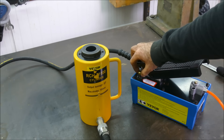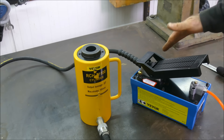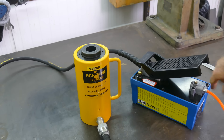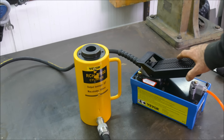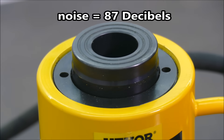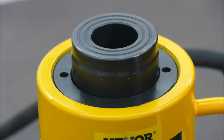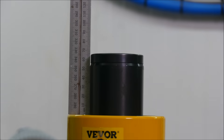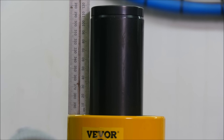To operate the pump, you need to release the valve, which allows air to get into the system. When the pedal is in the up position it's releasing the return valve; when it goes down, nothing happens — it's only until that little button gets pressed that the thing starts operating. The first official test I want to do is measure how fast the stroke is, so I'll look back at the footage to see how many millimetres per minute we're travelling. I also measured the retraction speed.